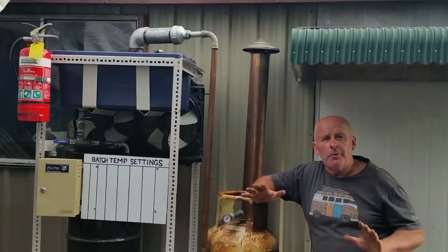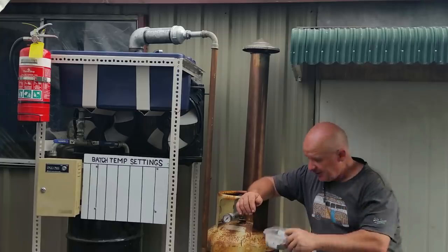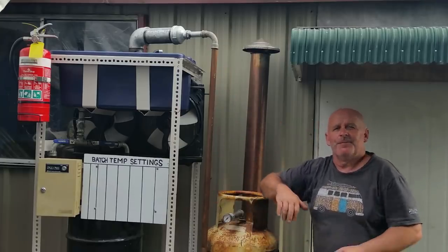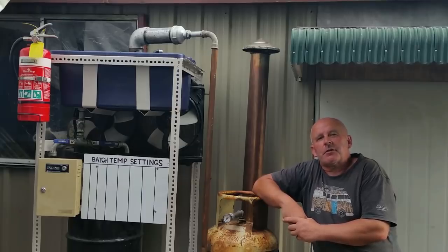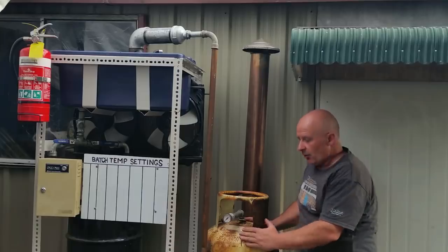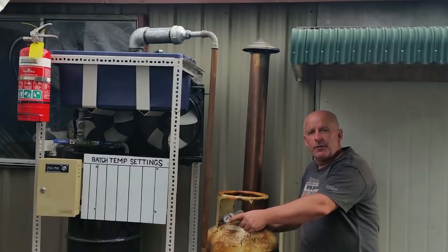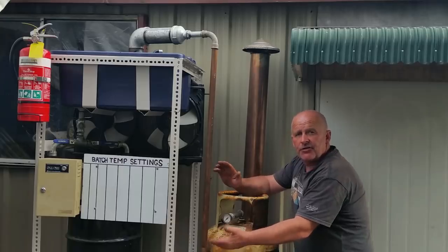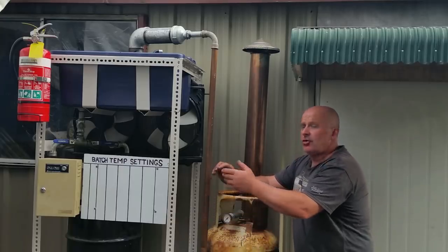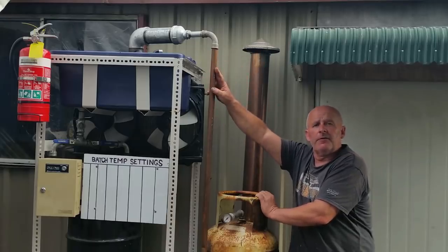One thing I want to make sure is that nobody loses their marbles today. I've got my marbles in the container and the rest of my marbles have already been put into the reflux tube. It's a novel idea, but I figure that putting marbles down the reflux tube will achieve two things. Number one, it's going to create a restriction in the outlet to the reaction chamber and that will help build pressure. We're only looking for three or four pounds per square inch, but that small increase in pressure will improve the pyrolisation by holding the long-chain hydrocarbons in the chamber until the heat has broken them up.